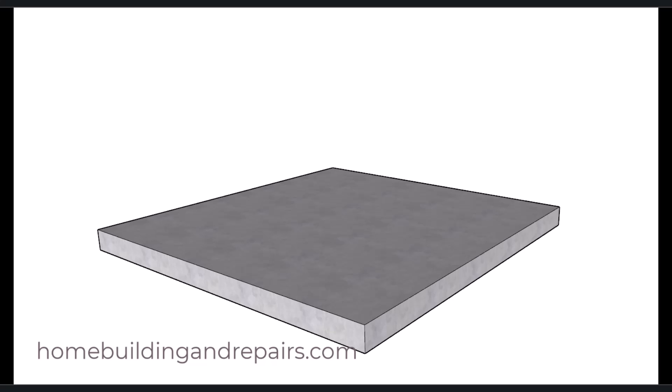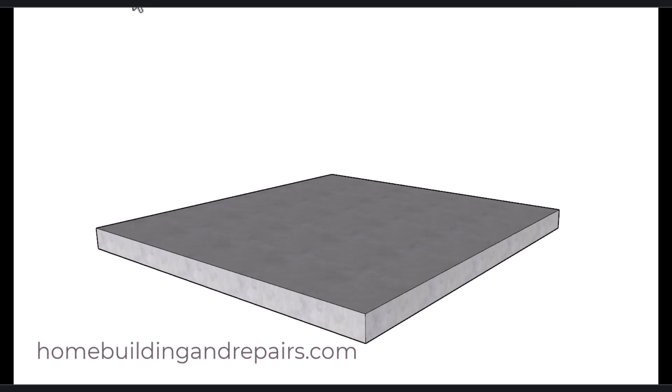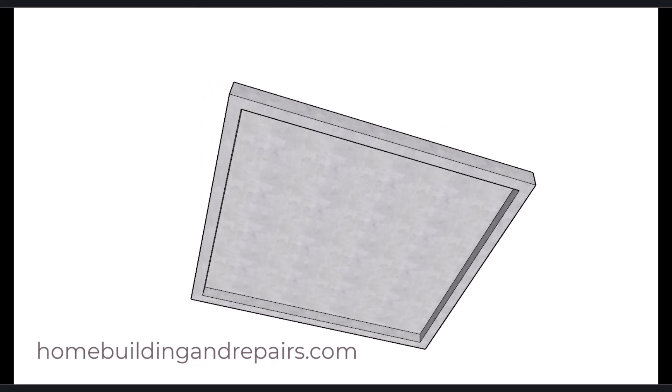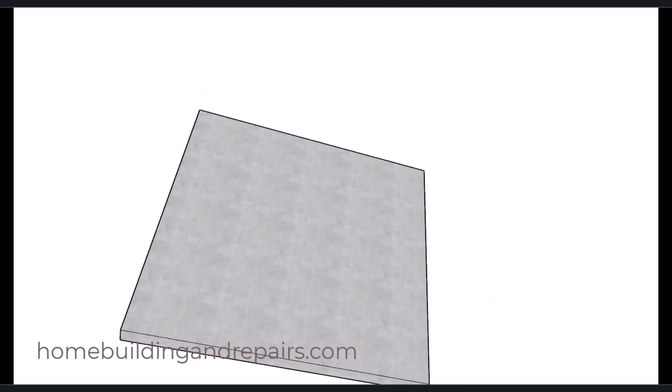Let's go ahead and remove the building so that we can take a look at the footing placement or location underneath the home. Even though I drew this footing in for future home designs, you will not need this if you're going to have a truss roof, because all of the interior roof loading will be transferred to the perimeter walls, which could save you a few dollars during construction. Of course you will need anchor bolts — I didn't draw any anchor bolts in here to fasten the home to the building foundation.